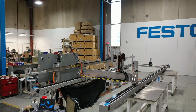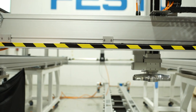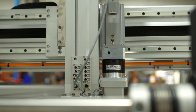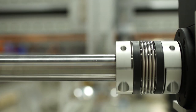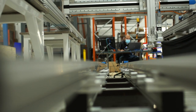One thing I'd like to mention is that an option for a customer could be to use a robot. However, the benefit of using a gantry over a robot is that in this situation a robot would need a seventh axis, and because of the reach, the robot would be very large and very heavy. Because it's large and heavy, your supporting structure would be very complex and expensive. In this customer site, the robot would actually have to be inverted — mounted upside down towards the ceiling — which is very costly and potentially dangerous. This is where the four-axis gantry system works very well.